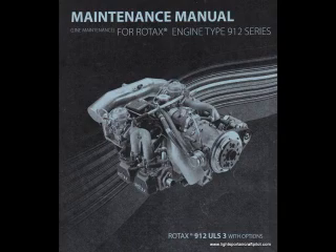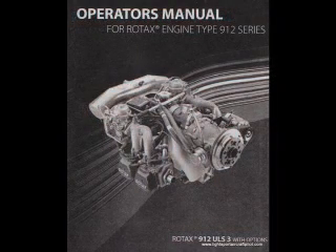And the second course then moves on to what? Once we've completed the two-day service course, the second course moves into line maintenance. Line maintenance is more for the more progressed mechanic who's going to be physically taking components off the engine. For example, when it comes time to service the gearbox, you'd need to know how to take that gearbox off the engine to send it to an authorized repair station for servicing, or for any of the other components.